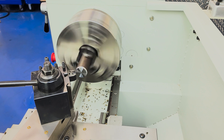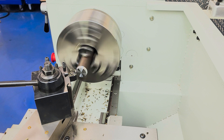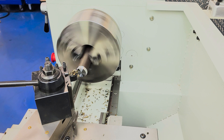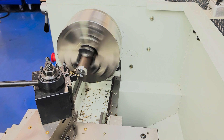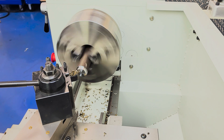The tooling we're using in all these shots is the carbide insert tooling that comes with our BXA master turning and boring set. It uses the popular CCMT and CCGT 300 series inserts. That's a common insert type so you can get replacement carbide inserts from us or from your favorite tooling supplier.